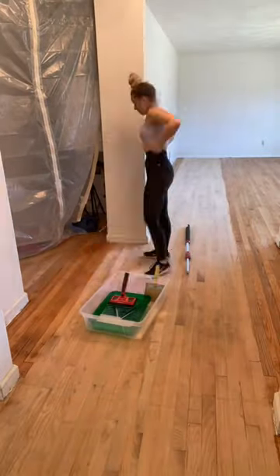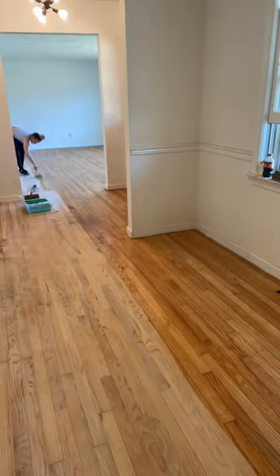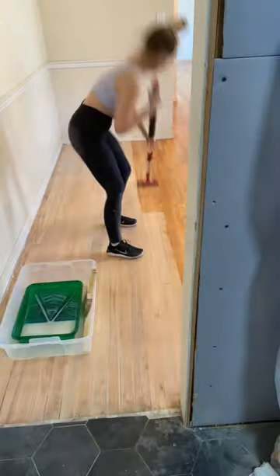I'm going with the grain and I did use my little pad applicator, but I would go back with a brush just to make sure there were no globs. I'm going the full length of the floor to make sure it's even and nice.